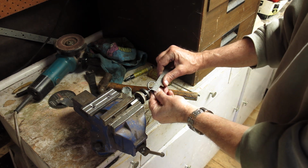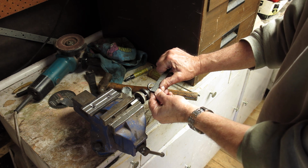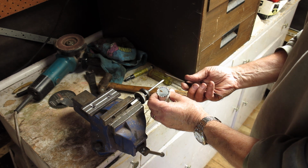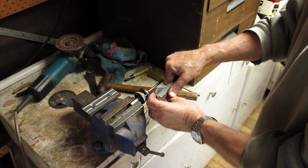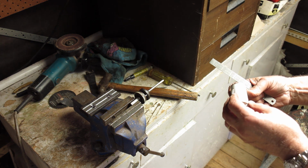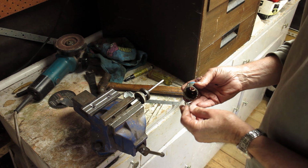This retaining ring here for the AGFA. We're looking for a tool about 29 millimeters in diameter. This one, the disc we're likely to get out of that is somewhat smaller than that, not by much, but by enough, probably 27 millimeters. That's no good. We'd need the next size hole saw up from that, which would be 32. We're looking for a 35, I think. I'll see if I've got one. So this is the one we want.